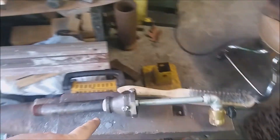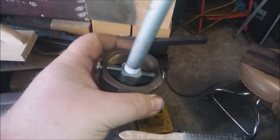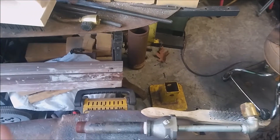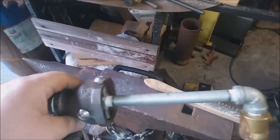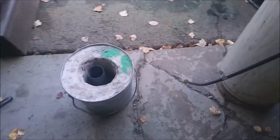This is my burner. This here is a three-quarter black iron pipe, and this here is a three-quarter to inch-and-a-half reducer. Inside here there is a pipe plug — it's brass — and I have a hole drilled through it. I think it's a 57 drill bit, either 57 or 52. I've got no air choke on this; I don't need it. So we're gonna hook up the crucible and give her a go — I'll fire it up and get some copper pieces in and we'll see what happens.